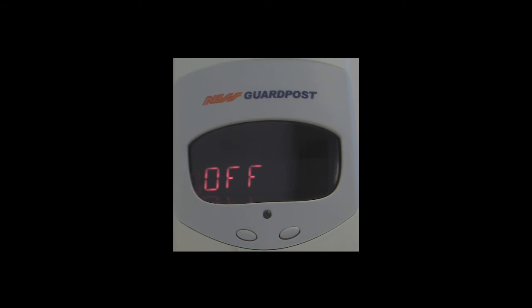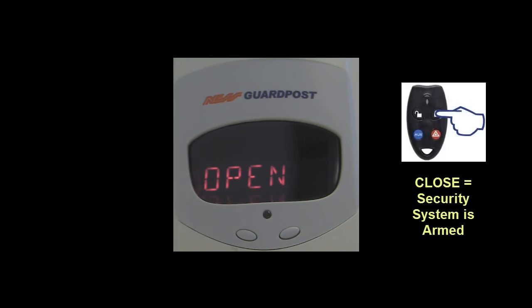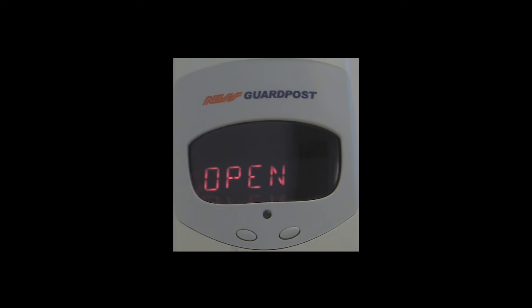Pushing the off button on the radio key takes us to the next option, which is open or open/closing reports. Open/closing reports are typically used if you have the dialer activated — whether you're going back to base or reporting via SMS monitoring — to report every time the alarm system is turned on and off. Open refers to when the security system is disarmed, and closing is for when you close the premises or arm the system. If you enable opening or closing reports, then every time you arm or disarm the security system, it will notify you of when the system has been opened and closed.